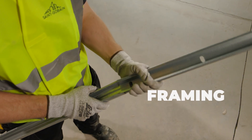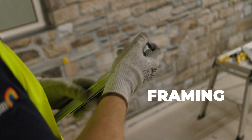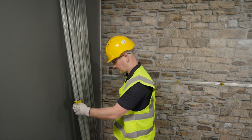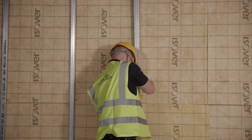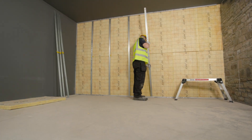For each Optima C channel required as a vertical stud, insert a 500mm extension piece into one end — we'll call this the top. About 1.35 metres up from the bottom, click in the female half of the Optima support clip. Insert the bottom of the vertical C channel into the floor U channel and engage the Optima support clip pieces together. You can slide to adjust the clip location at the back of the C channel if required.